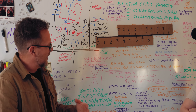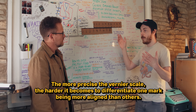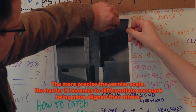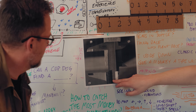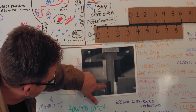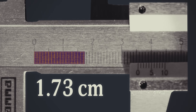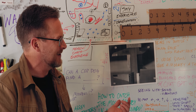So before the digital ones, how precise could a pair of calipers be? Not everybody's doing tenths of a millimeter. You can do half that, you can do double that — it's just down to the precision of that particular caliper. I've got a photo of an actual analog vernier caliper. Oh yeah, you can definitely see it's doing exactly this. This is our real ruler and this is the vernier scale. You line up the zero mark — so it's three and something. You see which of these guys line up exactly, and it looks like the five lines up. The zero falls in between the five and the six, so 3.5, and then the next digit is going to be five — so 3.55.